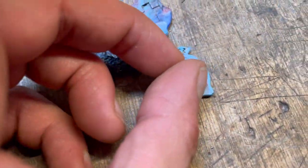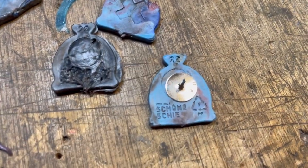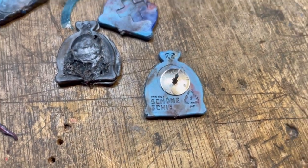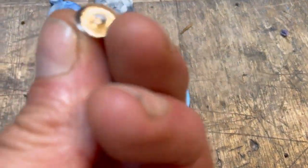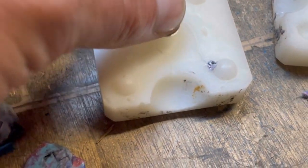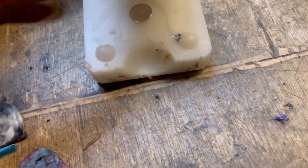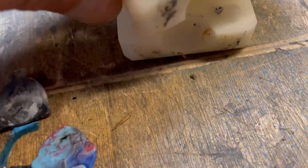Since it's pretty hard to glue something well to polypropylene and polyethylene to attach these pin bags, I had to come up with something else. So I drilled a little hole in the mold, shoved the pin bag in it halfway, and put the mold back together to see if I can encapsulate the flat part of the pin bag with molten plastic.